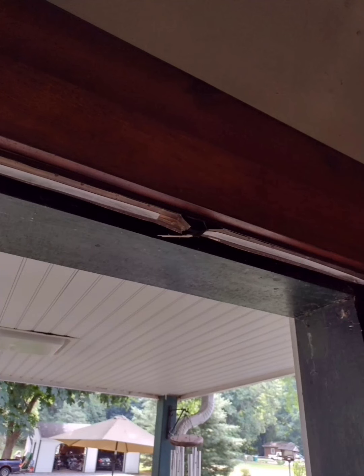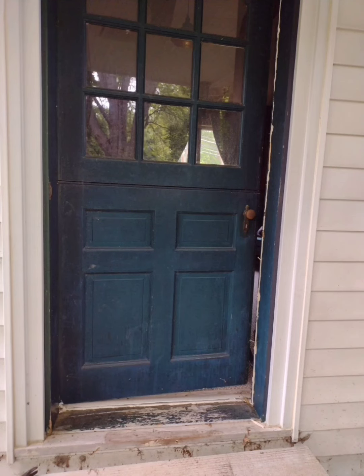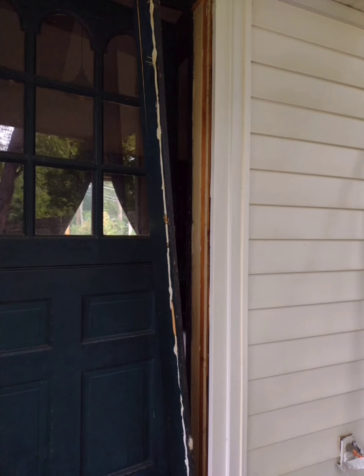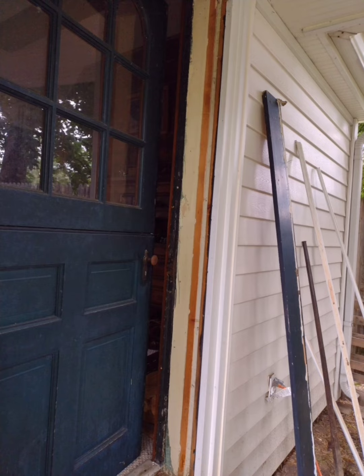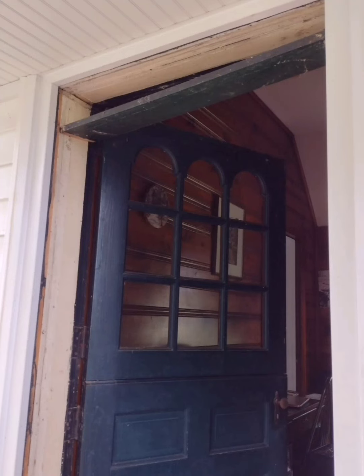This picture here shows the old brass weather seal that I'm tearing off around the door, getting ready to pull the threshold sill off. That's a Dutch door — I believe they moved it from another spot in there. I'm taking the jambs off first before I can pull the threshold out. Definitely no caulking or anything behind that homemade jamb, so that's definitely why the cold air was making its way in, and that old-school brass weather strip.